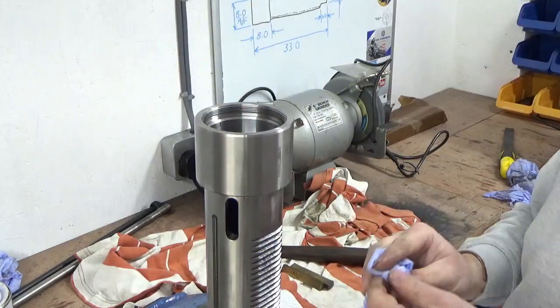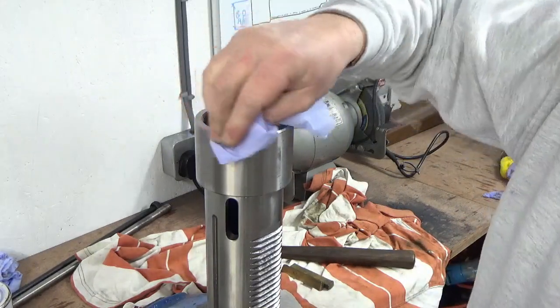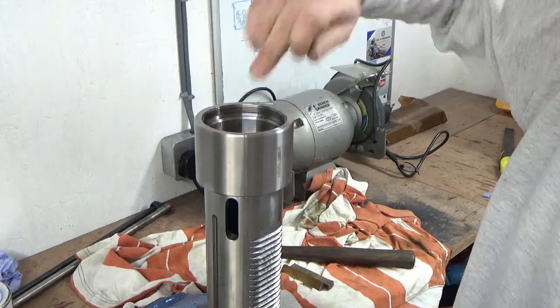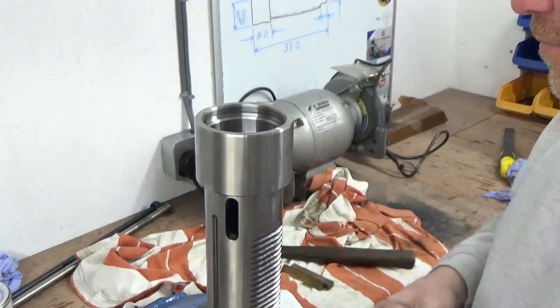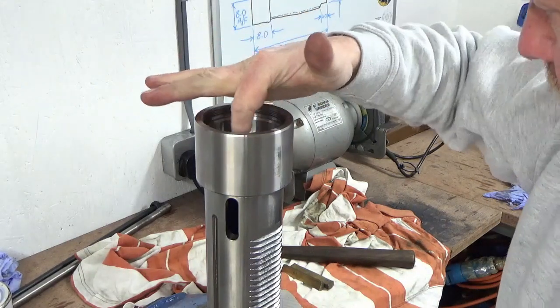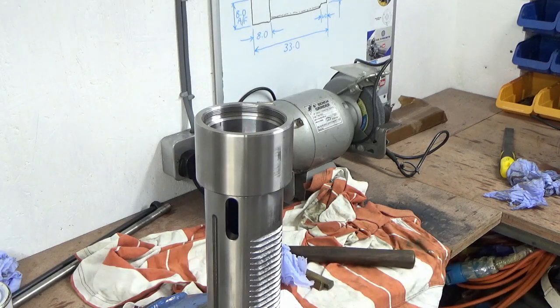My quill is in with my rather unconventional paint job now finished inside, so that's all nicely sealed — no muck coming down from that unfinished bore. I'm just going to give it a final wipe over to make sure that bore is absolutely spotless before we put this bearing in. I've started with the most contentious bearings because talking about preloading spindles and taper roller bearings seems to be quite an emotive subject — everybody's got an opinion. I've done quite a bit of research and I'm struggling to find anything in my manual or manuals for similar machines.